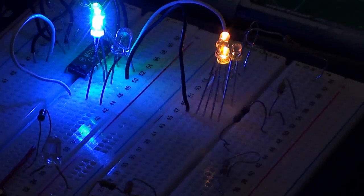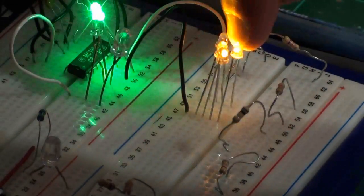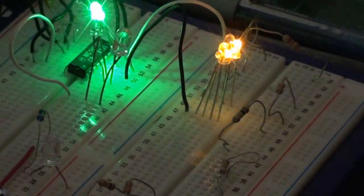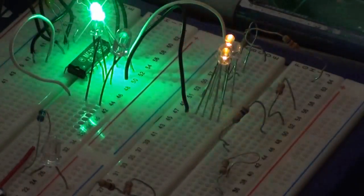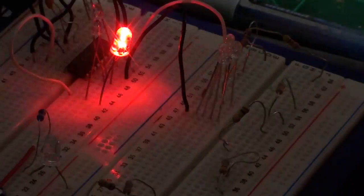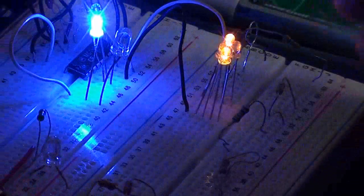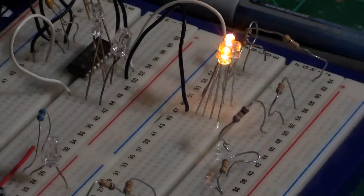Okay? I'm going to use the yellows, and in the center of them, I'm going to put a steady red LED. So I'm going to get kind of that effect, with a red in the center holding steady. And there's going to be a lens over it, so it'll look different than this. Alright? Now, I'm going to have to use 3 4060s just for this effect because there's 3 engines on the side of the ship. Okay?